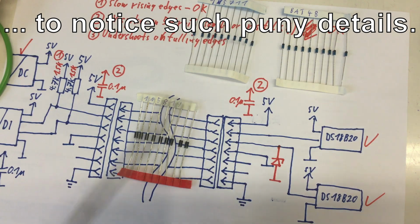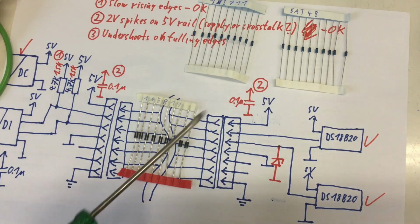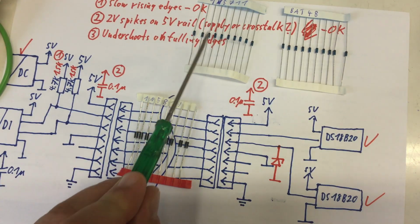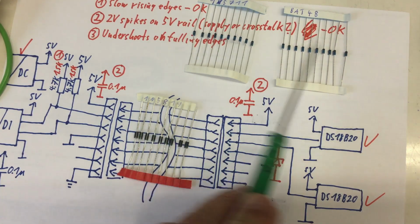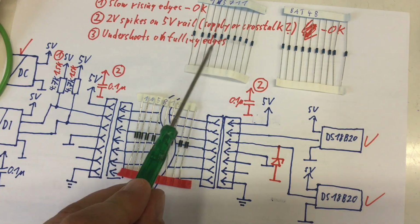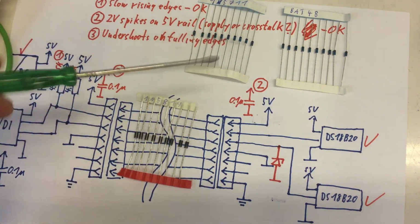But maybe some 20 years later or even longer, we can do even better, because I have here 2 other Schottky diodes. I don't know which is which. I went shopping and bought a lot of Schottky diodes, obviously. This one should have an even smaller voltage drop on small currents. And this one, or the other way around, I think this one is a high frequency one for a radio frequency application, which should be able to react even faster to these sharp spikes.